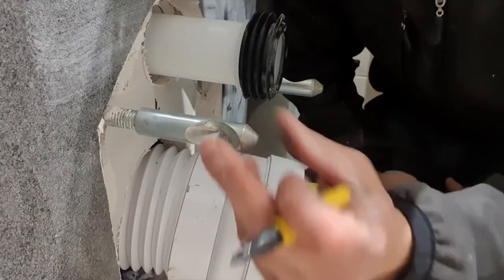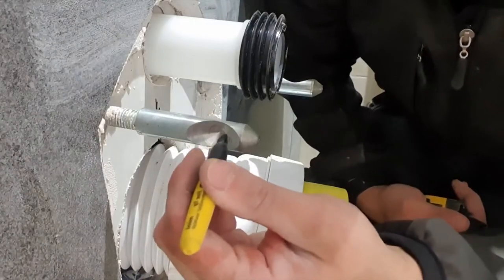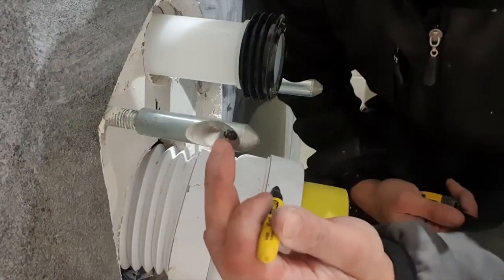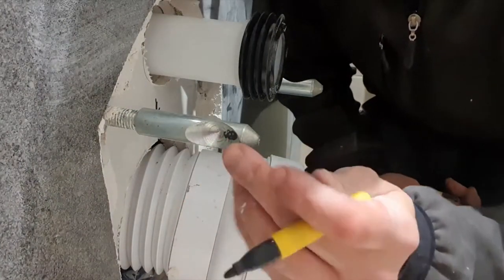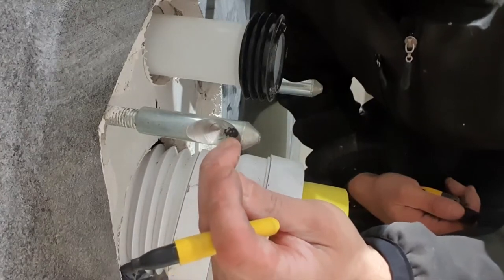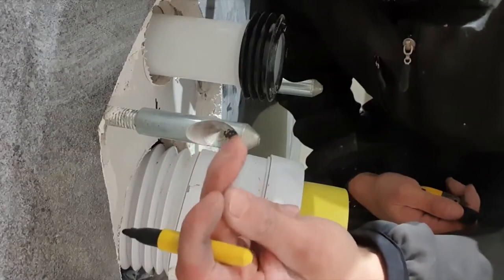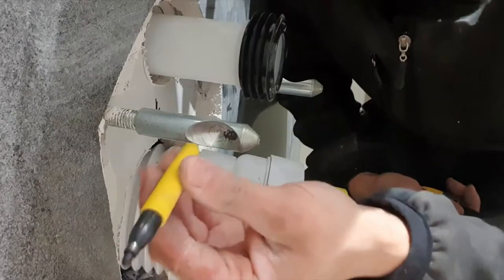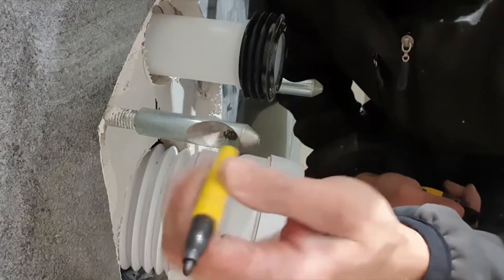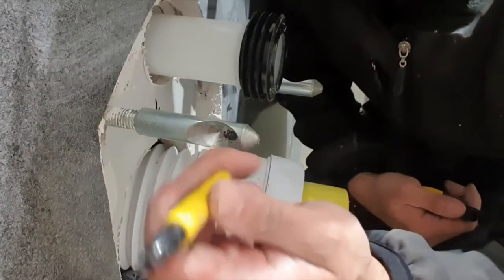With this, the Allen key and the grub screw wants to land here on the outside, around about here. And as it lands there, the grub screw is going to start slipping more towards the center, because this scoop is almost like a wedge. Yeah? So imagine that slipping like that. That's going to draw the pan to this wall. You'll feel it automatically as soon as you tighten.